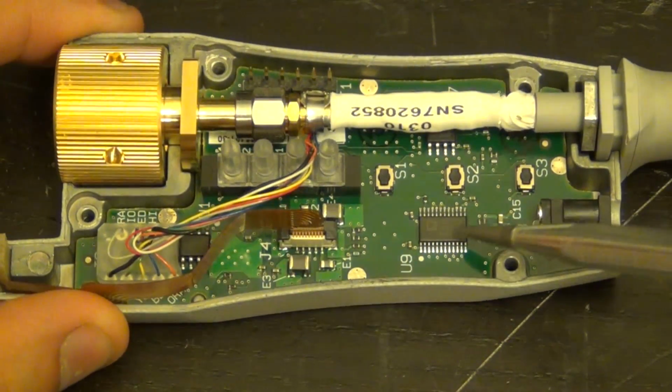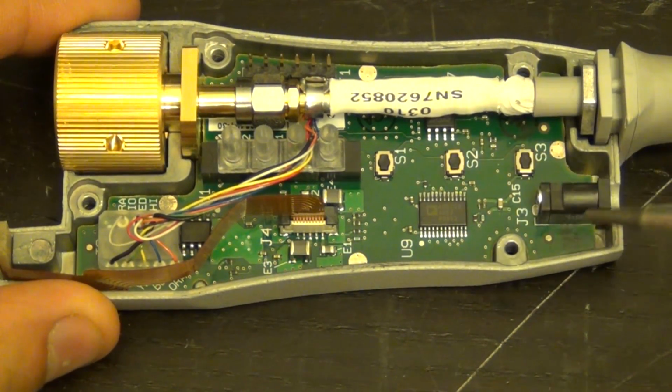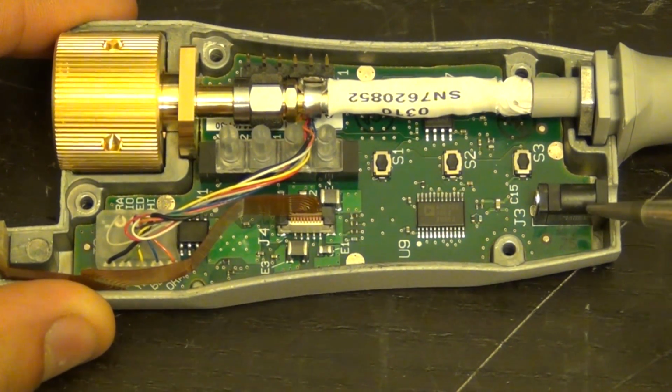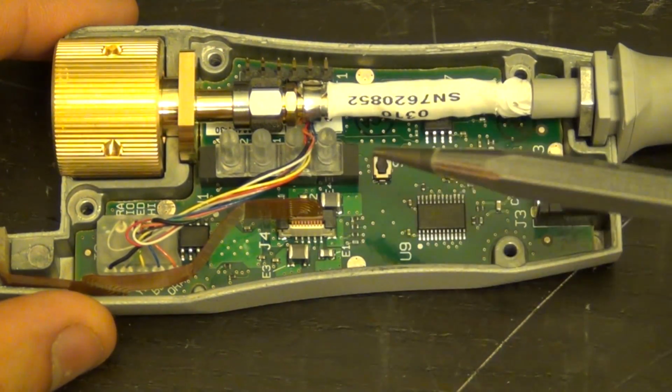Now let's look at that and see what this Analog Devices part actually is. But very straightforward, otherwise there's not much in here. This DC connector that you see here is the common mode voltage, which you can set externally or internally by programming it directly into here.